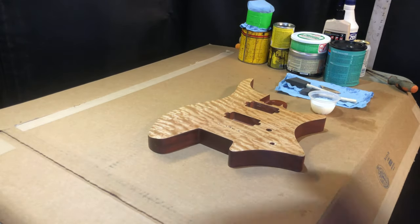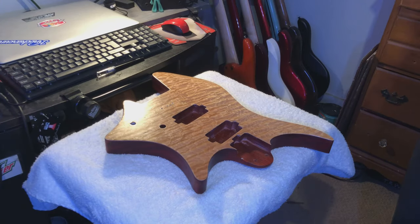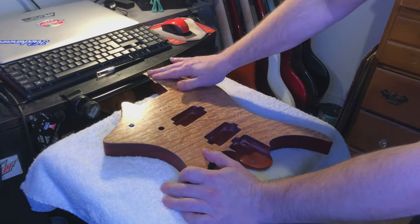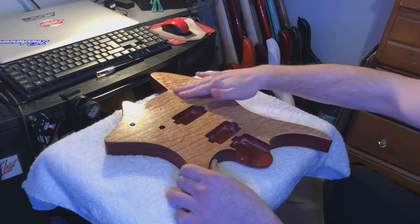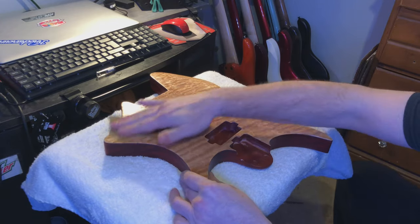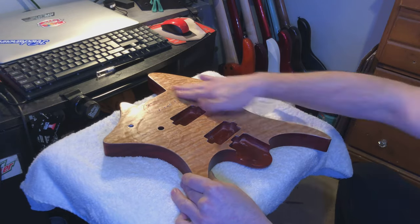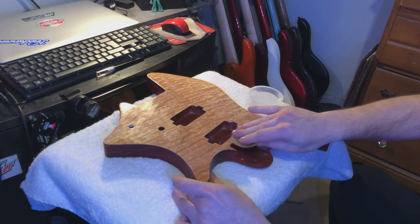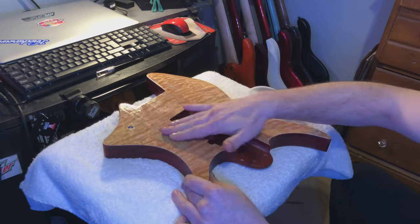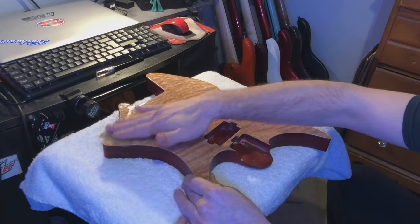The veneer had some pretty coarse little holes in the wood grain and some rough spots, so I just wanted to build it up layer by layer — I put like two or three coats on and then did a little sanding. People will argue that you're not supposed to wet sand water-based poly, and that's probably true to a certain extent, but as long as you let it dry and you're not too rough, you won't sand right through it. Just pay attention and check your work a lot — even if you do burn through it, you can fix it.